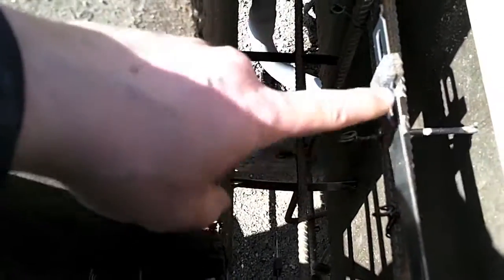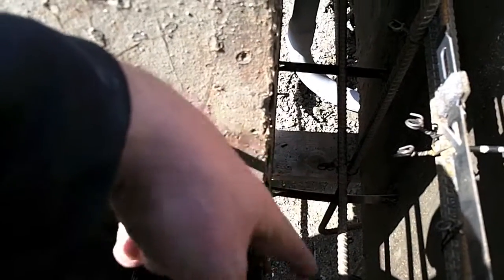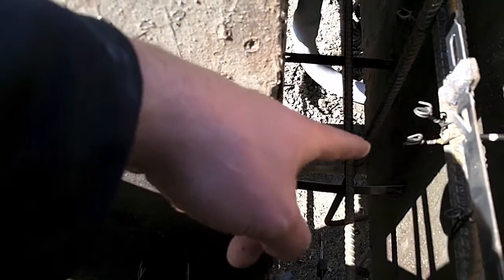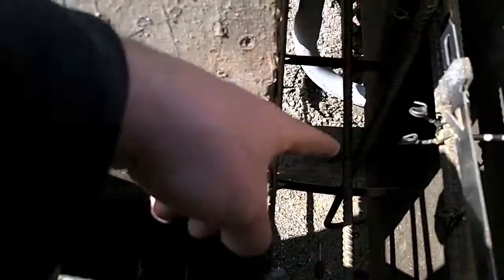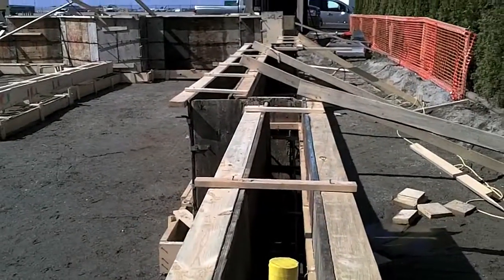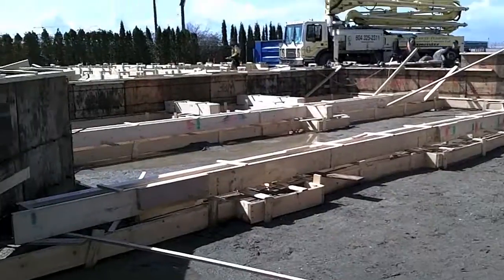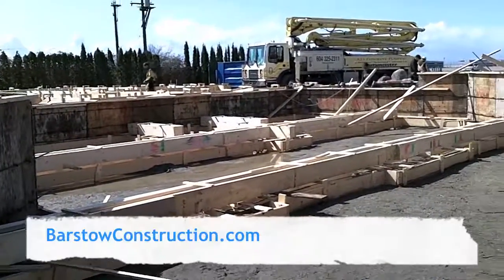Because this is a higher curb wall, we've got a lot more rebar. You can see there's the top row tied together, but with an L down to the bottom of this footing, so it's pinned down. You've got two rows that run plus vertical rows as well, all tied into the bottom. The base is tied to the curb — you don't get any stronger than that. We probably overdid it a little bit, but this house will stay still for a long time.